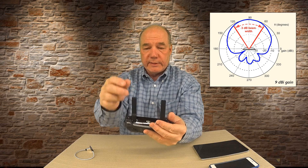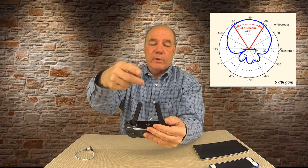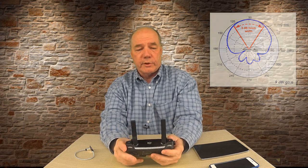One more thing about positioning: don't have them angled toward each other — have them straight up, parallel to each other. That way you get a nice balanced radiation pattern between the two antennas. If you spread them apart, you'll get what are called nodal patterns in between, creating black spots in the transmission. So keep them parallel, at 45 degrees, and you'll be in good shape.